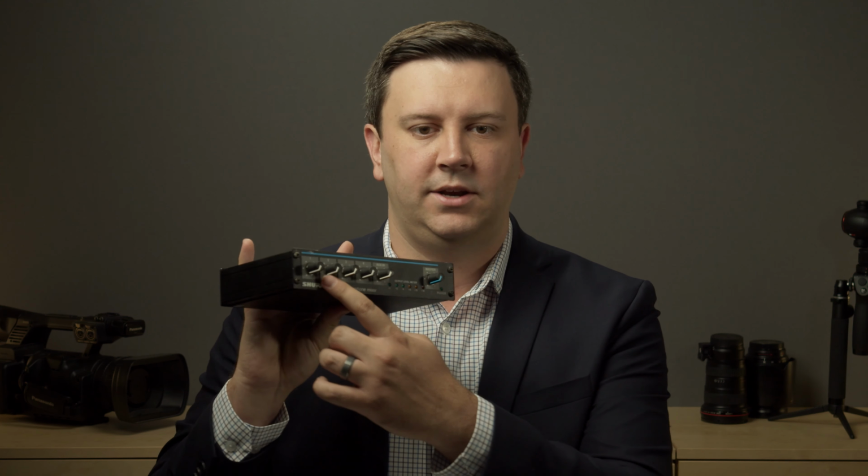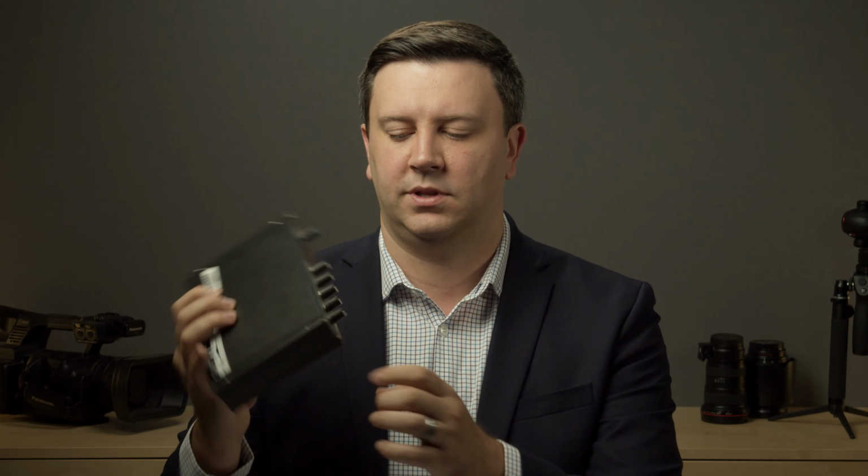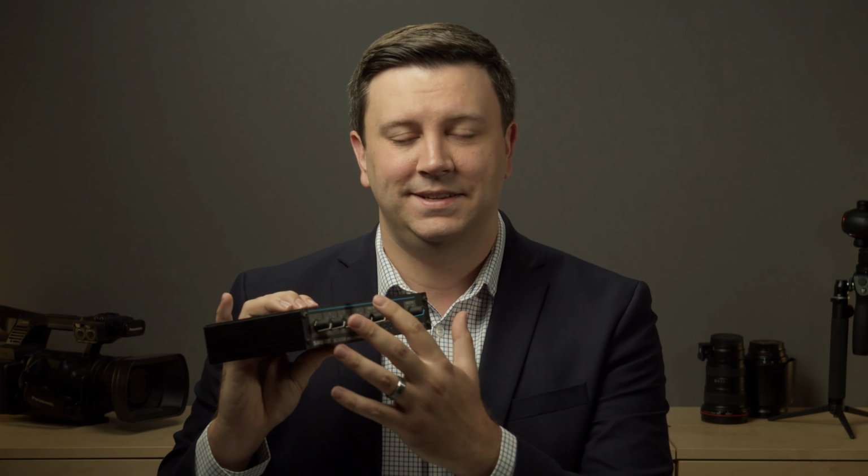The next thing that's important are individual gain or volume controls. The two terms, gain and volume, are really two totally different things, but they get used interchangeably a lot in deposition video, and especially on mixers where you just have one knob that controls the level of that microphone. You know, in the case of the SCM268, this mixer that I was showing you earlier, it just has one knob for input 1, one knob for input 2, so on and so forth. So is this gain or is this volume? Is this level? In this case, all those descriptors are kind of interchangeable, because at that point it's all relative to how you're using it.